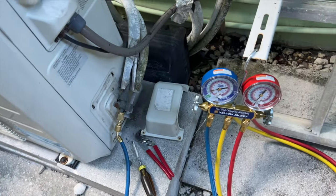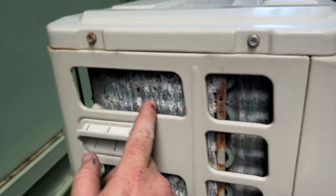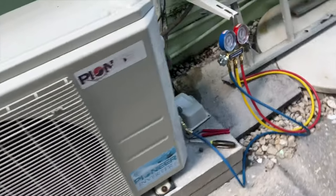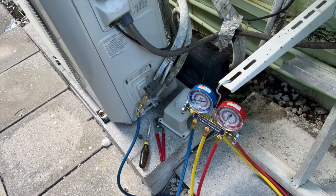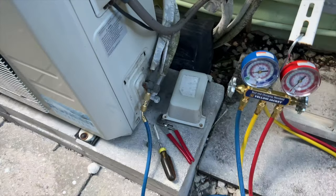I can throw some refrigerant in and see how long it lasts. You know, before I tell you to change it all out, let's see how long it lasts. All right, let's try that. We'll start with option A. All right, so on the mini-splits you've got just this one port here, and you can see the pressure on the blue line is way low. It should be up here — we've got either a leak or it came out of these coils, because they're not in the best shape. They look pretty damaged.